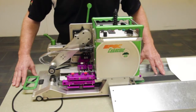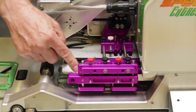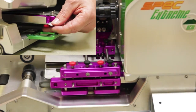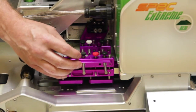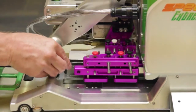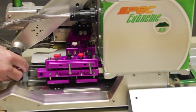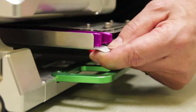For the Hem Cord Style Weld, the adjustment needed to the guide includes the interior purple part here, which is adjustable by the three red screws located in these positions. Loosen these screws so you can move this inner guide part either towards or away from the edge of the guide. It's best to bring the guide in towards the welding position and take a sample of the cord or rope you will be working with, and insert it here to make sure there's a nice, easy flow through this opening. Keep in mind you'll have not only the cord but also the material wrapped around it, so leave room for the cord to flow through easily. When this position has been set, tighten the three red screws.